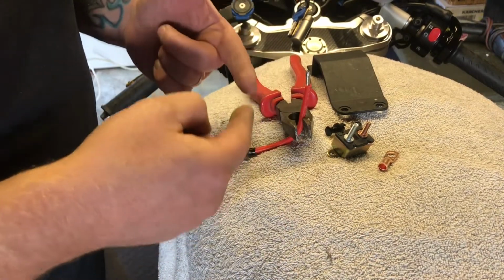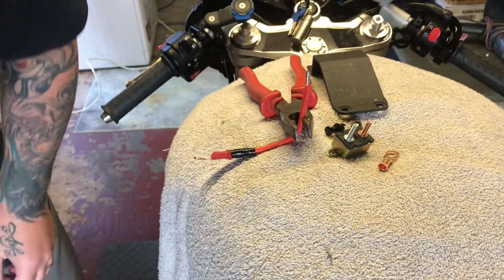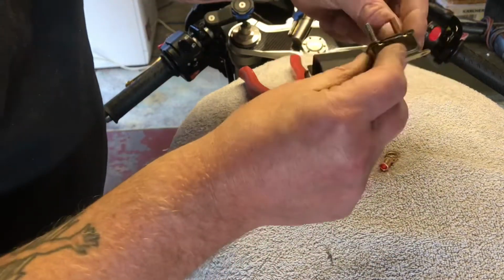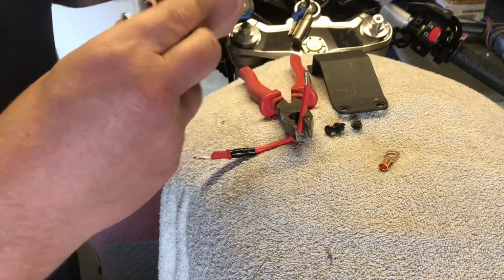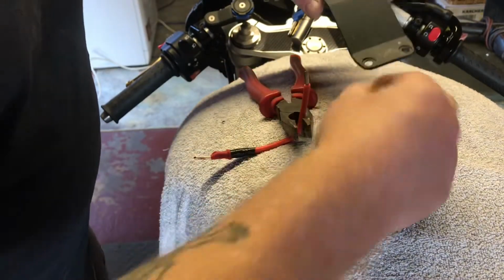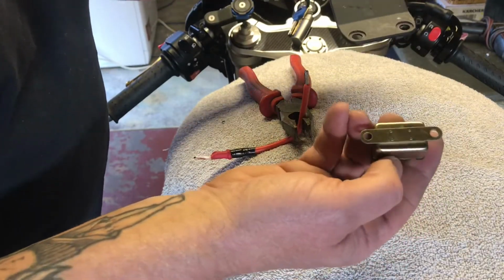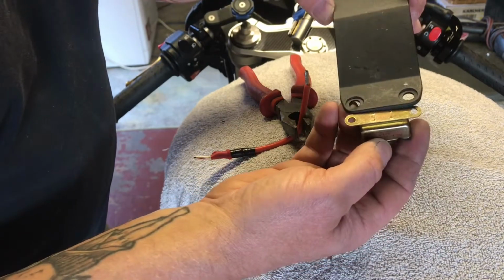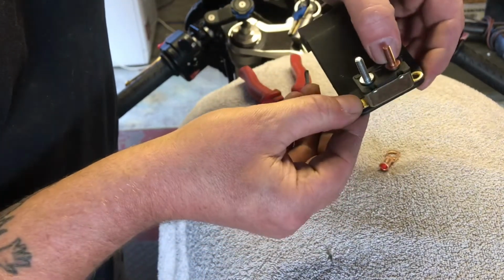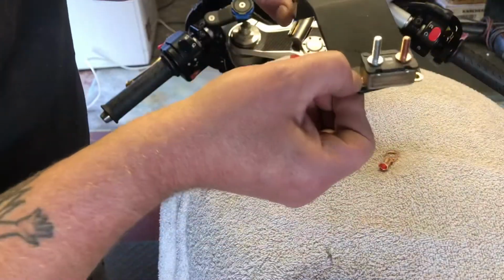Okay, so I've got that wire cut pretty short at the minute, so got all this spare, well not spare, we'll be using some of that, but it's always good to keep anyway, because it's actually going to be from the battery terminal to the circuit breaker. It's actually a short distance, and what I've just noticed is my little battery guard, which keeps the battery down, a couple of little pins going to the frame, are jiggered, so I'm going to have to work something out. Anyway, this has got a little fixing bracket, which actually lines up with those holes there, as you can see. Which also fits nicely in the battery box area, just keeps everything neat.